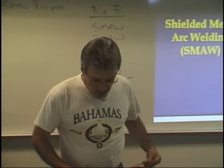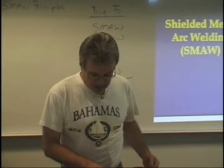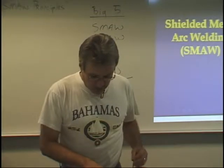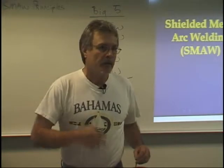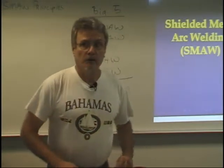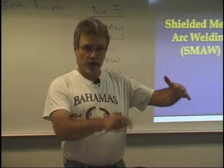It says, metals most easily welded by the shielded metal arc process are carbon and low alloy steels, stainless steels, and heat-resisting steels. Cast iron and the high-strength and hardenable types of steel can also be welded, provided the proper preheating and post-heating procedures are employed. So as we go along, you'll learn more about procedures. You don't do anything in welding as a code welder without some kind of a procedure. And a procedure is nothing more than a written description of how you're going to do it.